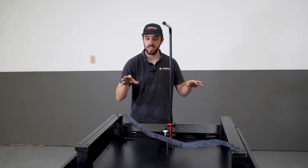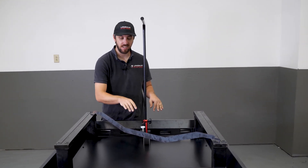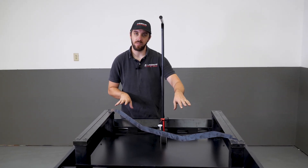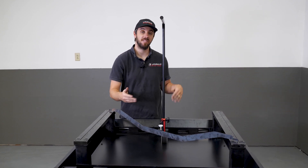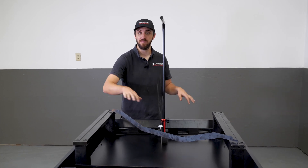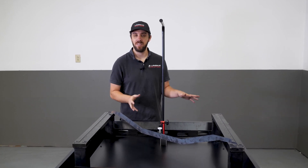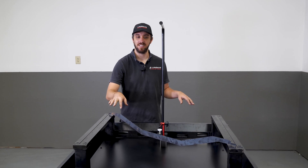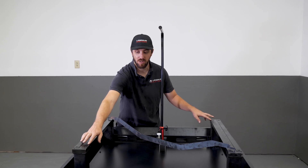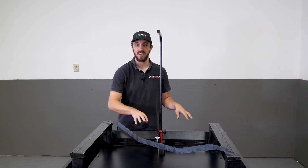Once we have the concrete in there and before we face off the base plate, that's when we want to dial this number into about two or three thousandths. If you've done what I've done and your error grew instead of getting less — say you started with 20 thousandths and it went up to 40 thousandths — that very likely means you put the shims in the wrong location. In that case, take the shims out and put them along the other diagonal, then check again.